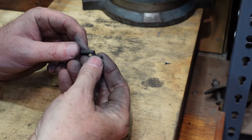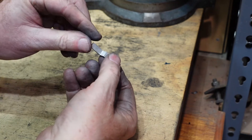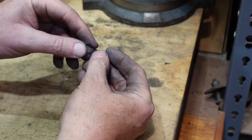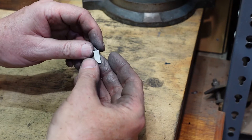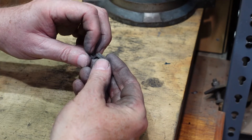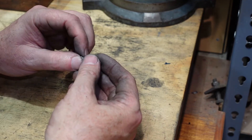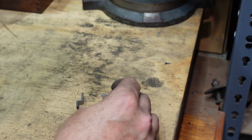So these are my efforts so far. I've ground that surface, that surface, and that surface. I set those on the edge of the chuck as I suggested, managed to grind that surface and then turn it over and grind that surface. The only one left to do is that. I want that to be precisely a quarter of an inch below that. In real terms it doesn't matter because I could adjust the micrometer, but it would be really nice to get that spot on.